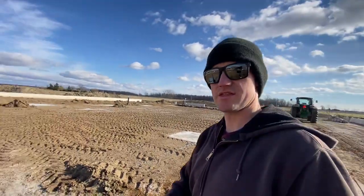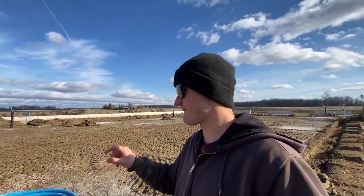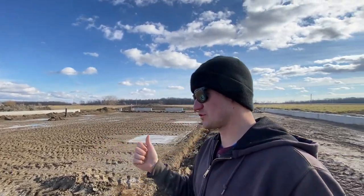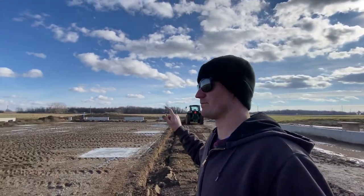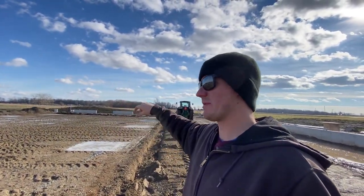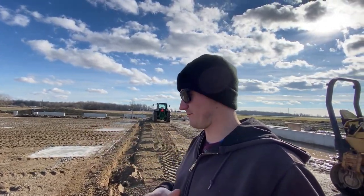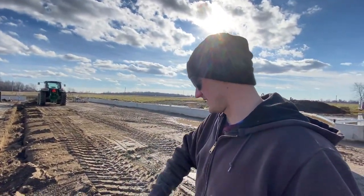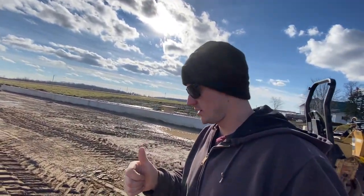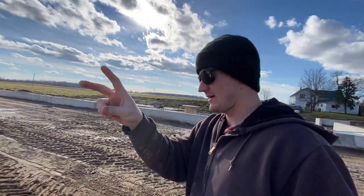It goes down here. The other thing we've got, these coils, are foot baths. The foot bath equipment is going to be in the utility room, and we'll be able to just program it to say, okay, create a foot bath down at the end on foot bath days, and then we'll be able to run cows through that foot bath area, and that just helps disinfect their feet and keep them clean. So we've got those three lines, basically water, two foot baths in here, as well as a drain line.